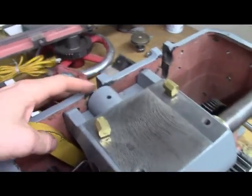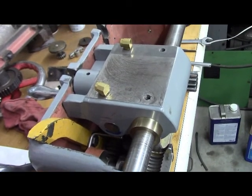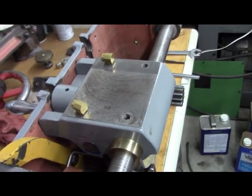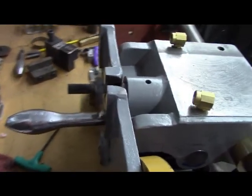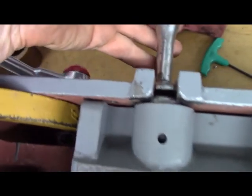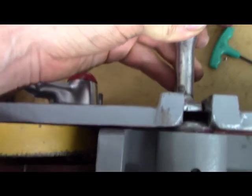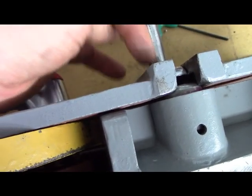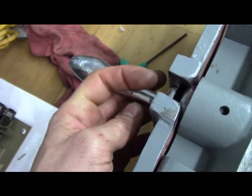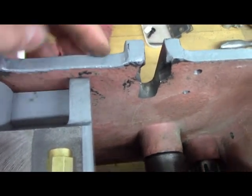Yeah. So, kind of frame you here. That's the rocker box mechanism, and it's installed meshing with a crossfeed, I believe. The way this works is you've got your disengagement lever, and if you pull it up, well, it's upside down, so that detent is not snapped in. You can kind of see it's a big plunger detent, and there's a recess in this slot. Oh, duh. This is what it is. So there's the slot for the handle.